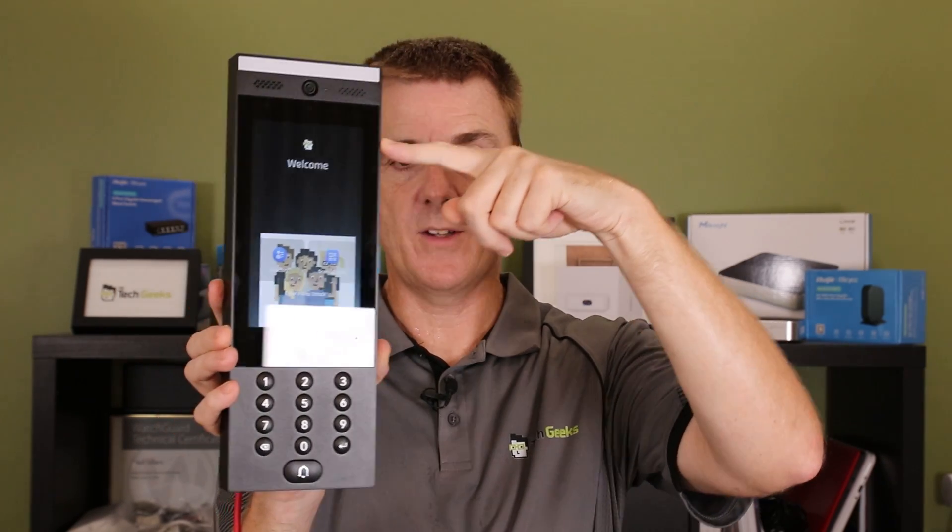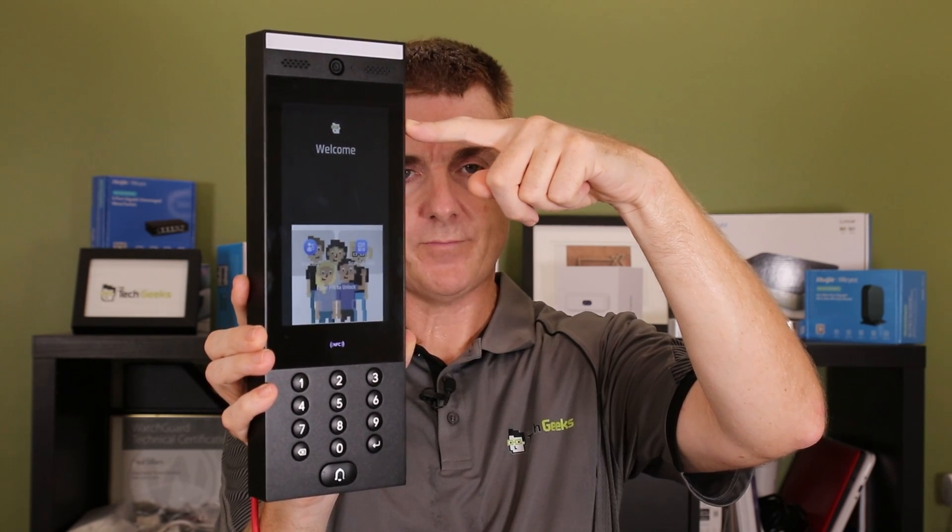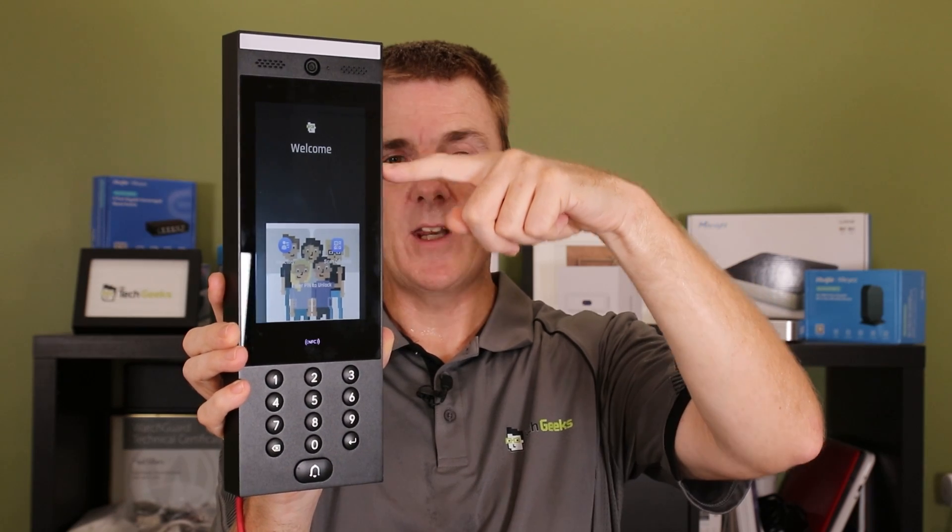You can customize the logo — I put a little Tech Geeks logo at the top there. You've got at least two lines of writing and then a background image. There is talk that they might in due course remove the directory option, which would be really helpful. You can rename the attendant to 'main building' or 'house' or something, or change the writing at the top to say 'push doorbell twice' or something. If I push that twice, it calls the one at the top and makes the call. If I had a G4 UP chime running on my UniFi Protect, I can tie that to it and it'll actually call that chime, or it can call the app on my mobile device if I've got UniFi Access installed.